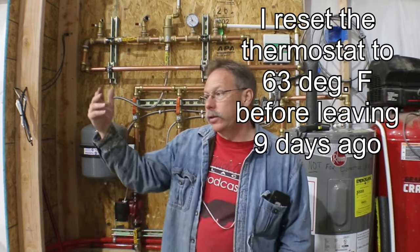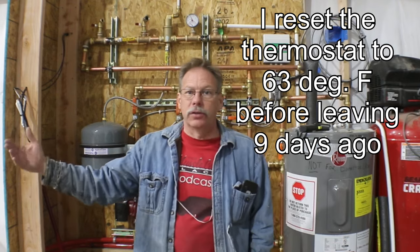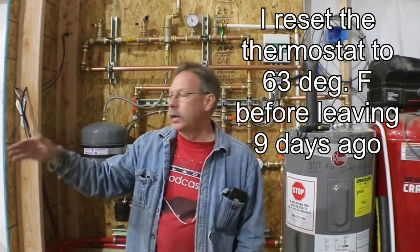Welcome back. It's been 9 days since the last part of the video. In that time, I've been gone most of it. I did get to play with the system a little bit for tweaking about 3 or 4 days in, and then again today. And what I've found is the floor is running right around 62, 63 degrees Fahrenheit, right where I had it set. And the building is in the low 60s degrees radiating off that floor.